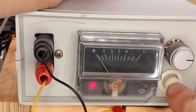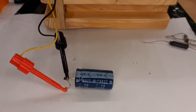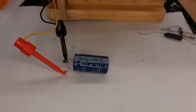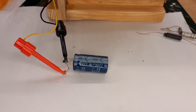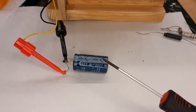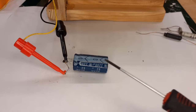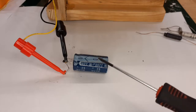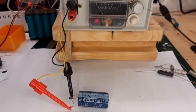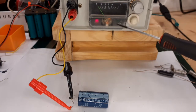So this capacitor is not leaking. If the capacitor is leaking, it could be possible to regenerate it by passing a direct current of 0.5 to 1 milliamp for a certain time. This will regenerate the insulating layer between the plates and the capacitor could stop leaking. If we leave the capacitor connected to the instrument, we are in fact giving a constant current to the capacitor, so we are performing some regenerating action.